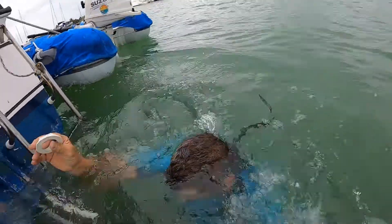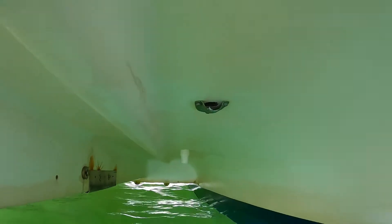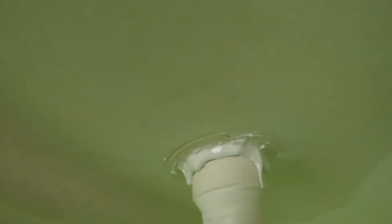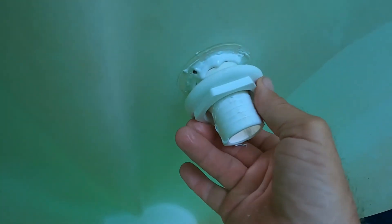I still got a gap in there — I'll put some 5200 in and then I'll put my lock nut on there. I'm going to go get my sealant. I've got no way to hold up my GoPro so I'm going to have to do this without you guys. I'll show the end result though. You can see I've put some sealant all the way around in that void and I'll put some on the back of the nut.